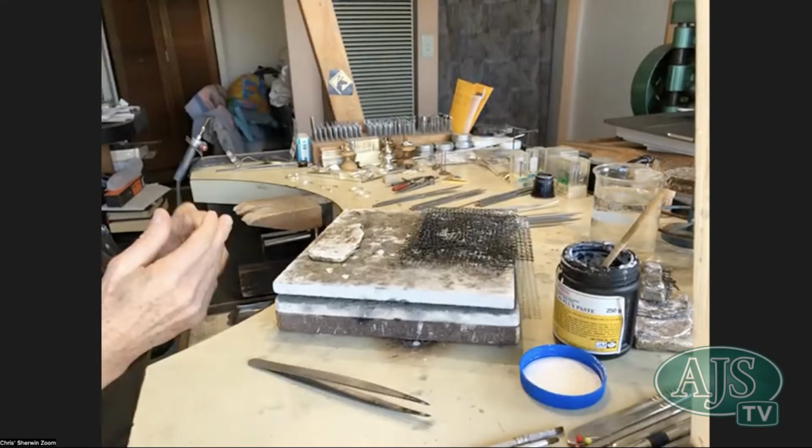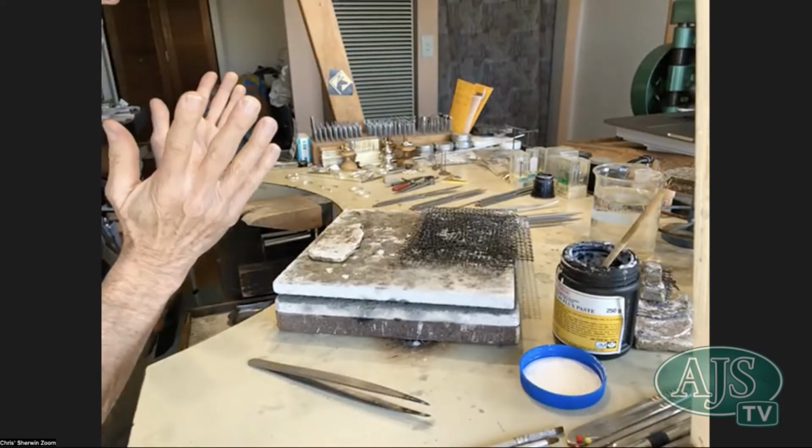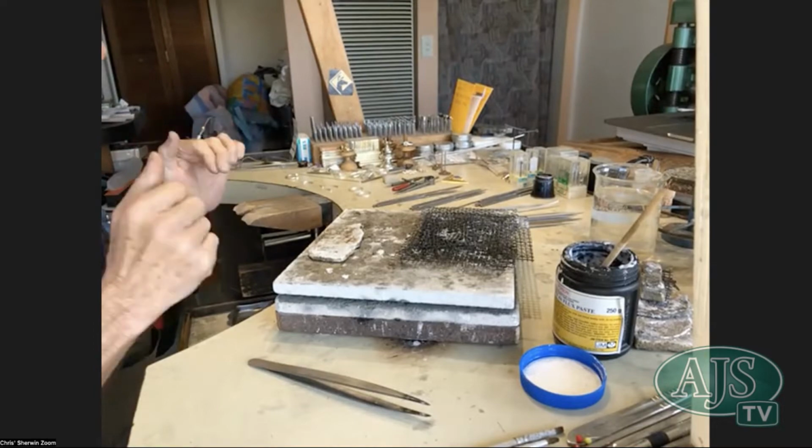often you'll be given a ring by a customer and you'll ask them, oh, well, has it been resized before? No, I got this from Granny. It's never been resized. And then you'll heat it up and you'll see 1, 2, 3, 4 joins in the back of the ring, and you realize it's been resized several times, because there's nothing worse than just taking people's word for it and cutting the ring through and putting a piece of metal in and realizing that it's about to fall apart because all these Lego blocks of resize are falling out. So very important to identify, if there is a join, where the join is.